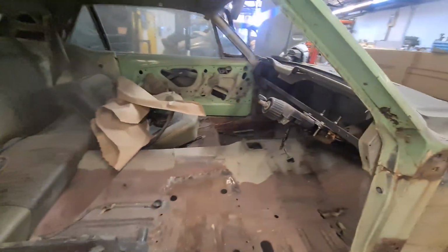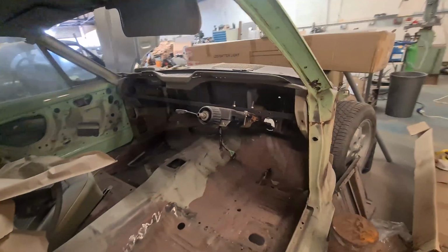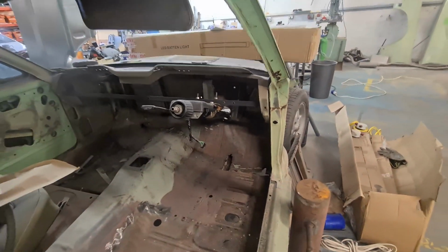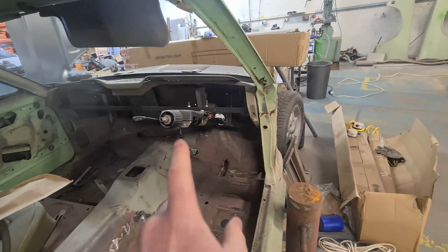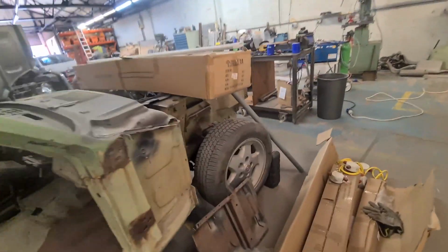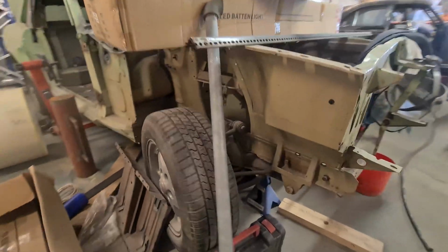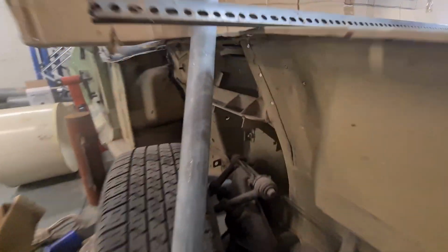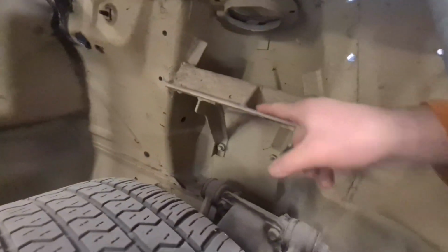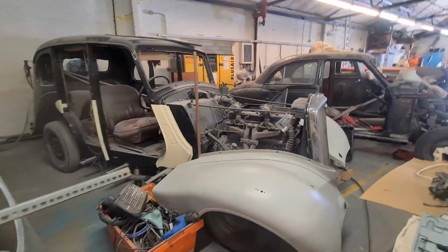non-undercover. So, as I said, it's been converted to right-hand drive, so it's going to be safer to use over here. It's using a Jaguar XJ6 front, XJ6 steering column, and then an XJ6 complete front clip. Because it's just a subframe, everything's contained, and then it was just a matter of mounting it to the chassis, which actually worked out quite well. There's a couple of little bits that Dad wasn't happy about, like the shock absorber towers. He just used a bit of angle that needs to be redone, but most of it's pretty good. So then we got this old Wolseley.